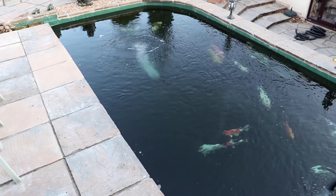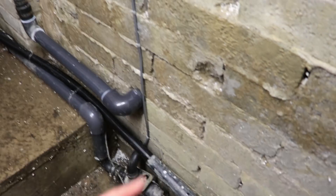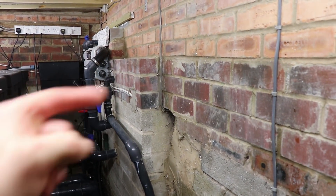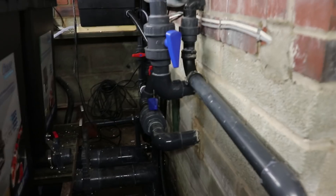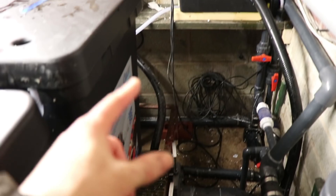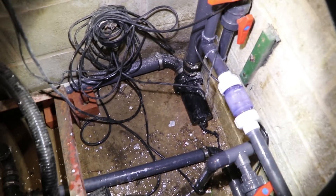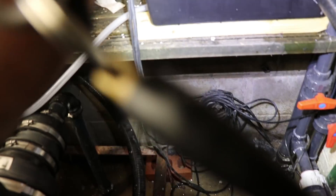Everything's running now. The 5,000 litre-per-hour pump goes straight through to the heater and the return from the heater goes up and then in through the wall. The main pump goes down there and also splits into that little bit. The water feature pump is up there going to the waterfall. I've put a T-junction on that line, and I've put the overflow in this tank here so there's now a little overflow - if the water gets to it, it overflows down the soakaway.